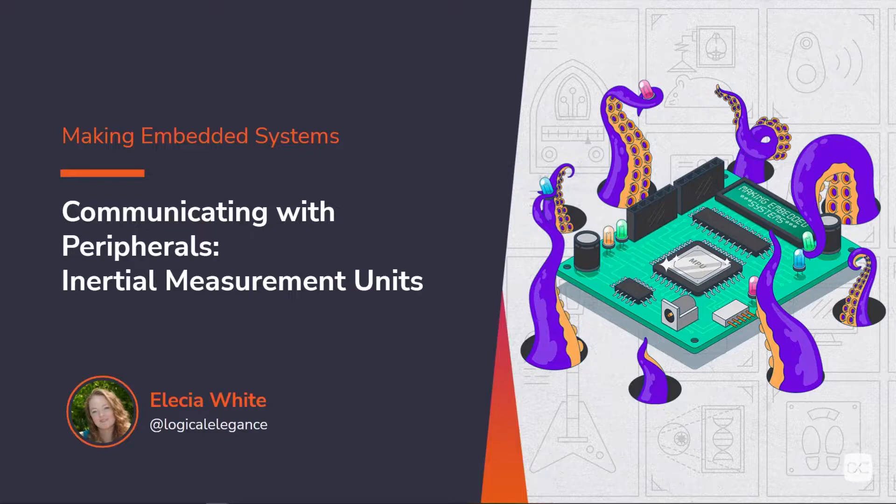Mostly it's about sharing my love of IMUs with you in case you end up using an accelerometer, gyro, or a magnetometer in your project. I'm going to make some assumptions about your inertial sensors: they're probably MEMS sensors — cheap and reasonably accurate. They're digital, which is nice because they won't get any noise added to them by carrying analog signals through your system. You're probably talking to them through I2C or SPI, and they're probably three-axis, although this all applies to single-axis as well.